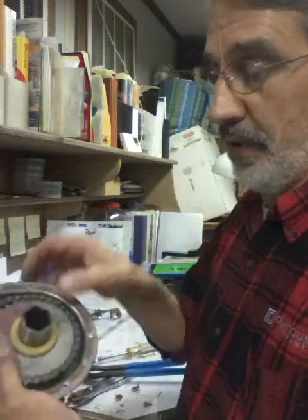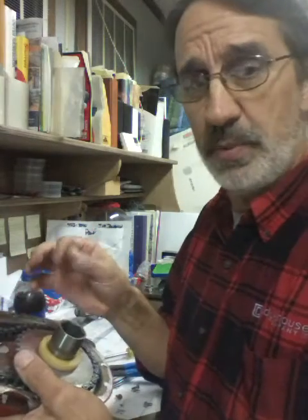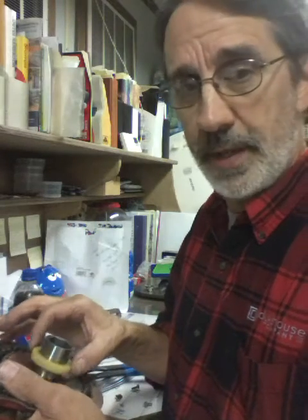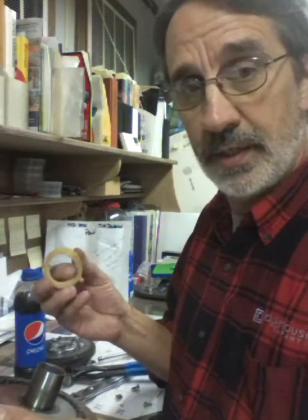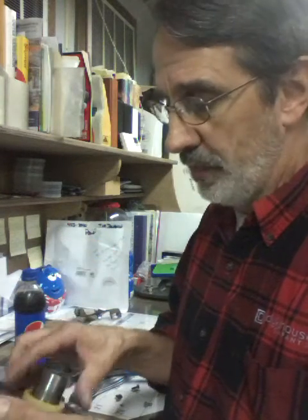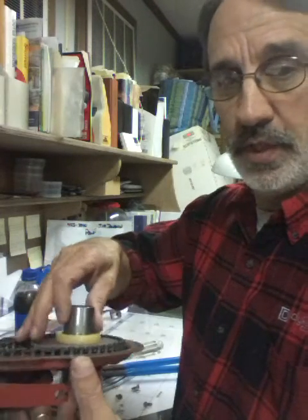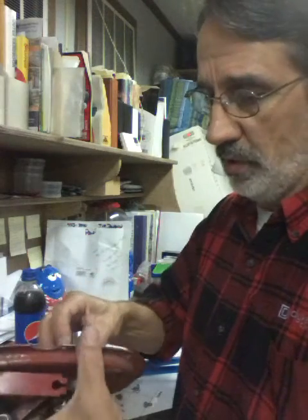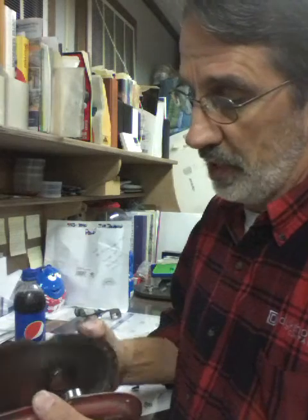You may have to put another nylon shim on top of this one that you can pick up at most hardware stores. They'll have a thin piece of nylon. It'll be a nylon washer. You could even slip one of them in there, but chances are this is probably what's worn, and you're going to want to replace both of them. That will take all of this side plate out, moving up and down or back and forth, however you want to say it. This one is in really good shape.